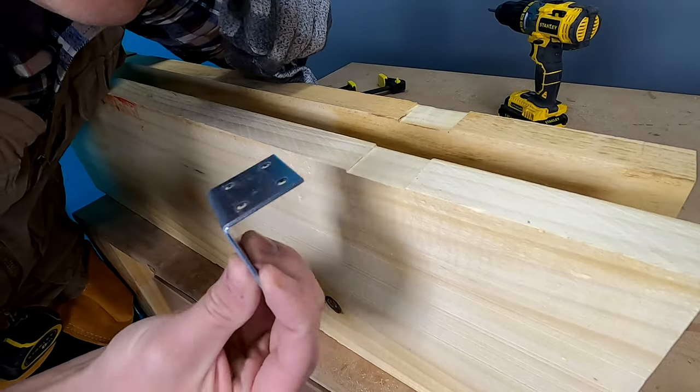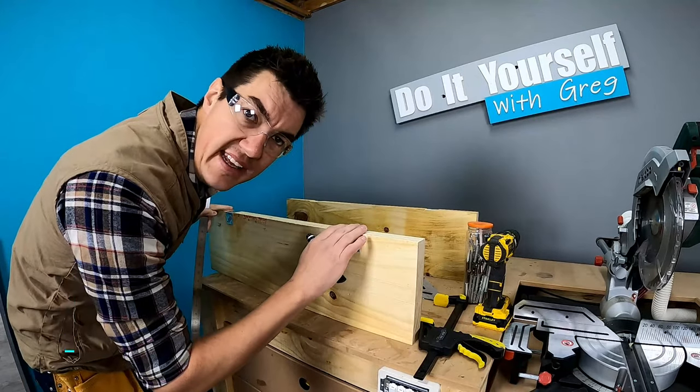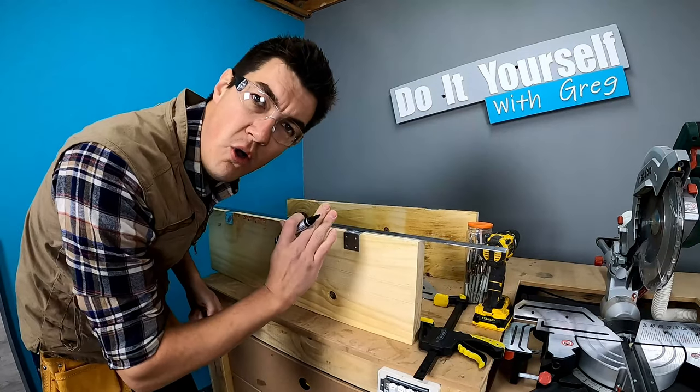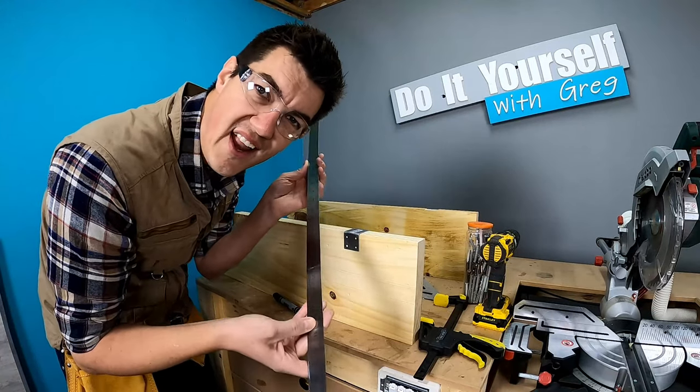My inserts have been cut, so my floating shelf will sit flush against the wall. How am I going to transfer my measurements from my bracket to my wall? Easy - take any large object, place it over your brackets, mark on your object exactly where you want to drill the holes on the wall. Now transfer your measurements to your wall like this.